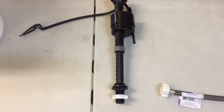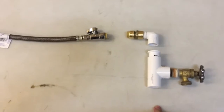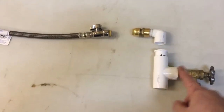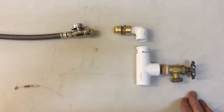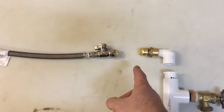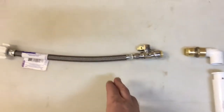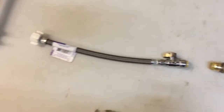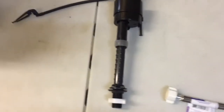Here is the supply — we have PVC just coming off the irrigation line that I'm going to redirect, so we'll have a tap here to fill up the boiler. I made a connection that sizes down to half-inch PEX, just a water shutoff valve that I can turn on and off when I'm not using the system.